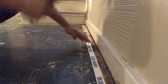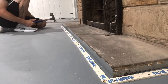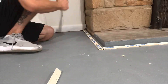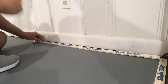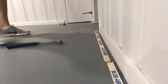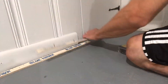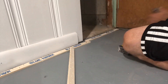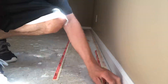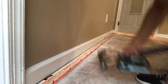Let's dive into a different scenario so you can see what's good. This is fantastic for going through tile, but let's go on a concrete floor straight up. This concrete is super agreeable, so we're going to go ahead and swing that hard body and nail those 11-16 nails directly into the concrete. But you can have many cases where those won't grab in your favor, and that's where you need those 5-8 nails — you can see them right there next to my fuzzy knee. Pick a box of those up at Lowe's or Home Depot — it'll make your life a million times easier working your way around the room trying to get things to stick.